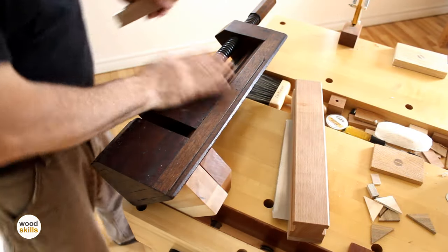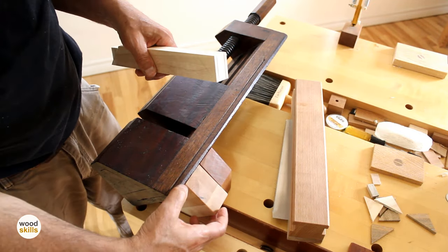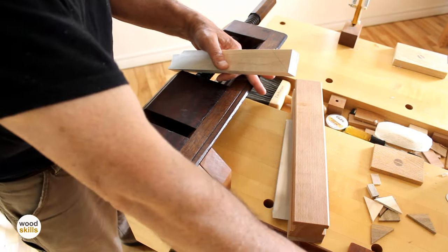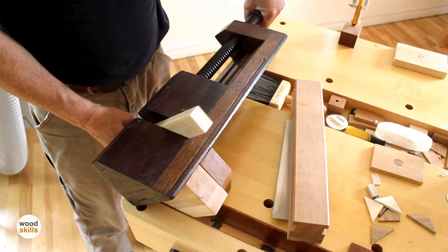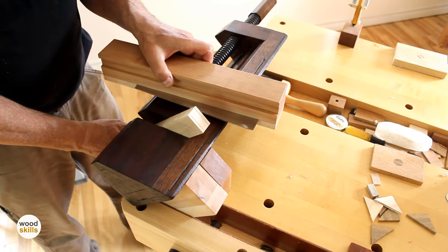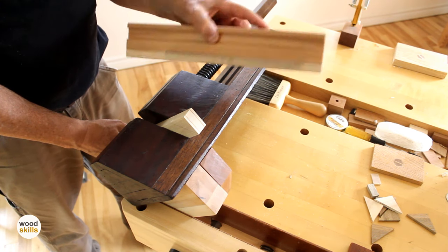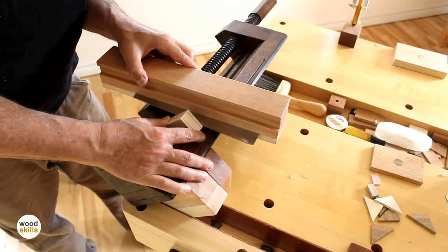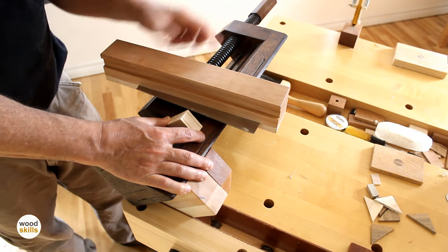So I have the miter jack set up at this face vise with that stabilizer block and the mounting block, the newer version of the mounting block. It's a little deeper, so it holds everything better, along with the spacer block. What I do now is I need to offset this from the base of the 45 degree face of the blocks to offset it sufficiently to clear the reference or the base of the miter saw. So I bring the saw along here and I set it along the line that I've established earlier on to create the miter, and then I just tighten it.